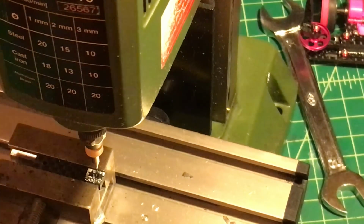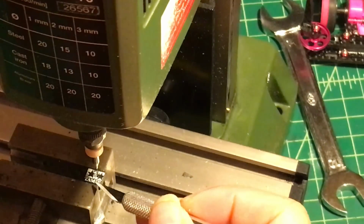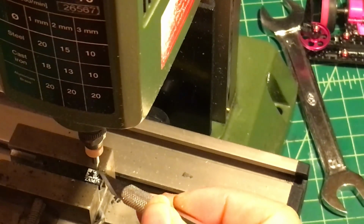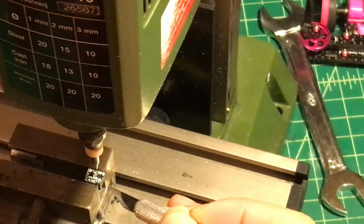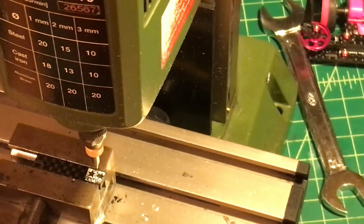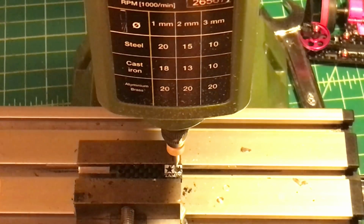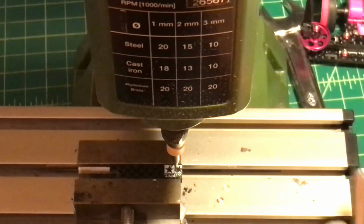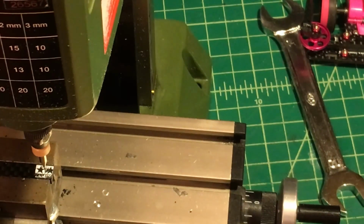Now I'm going to make another hole, which is right here from the 3 millimeter line, and remember the 1.5 millimeter line, which is right here. From that intersection point, I'm going to make another hole. For this one, you just have to move vertically up, and please do not move this side. Do not move this side. You just have to move up.